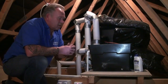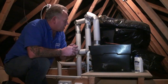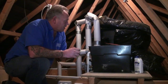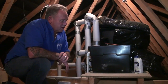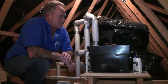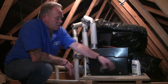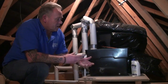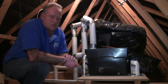So once again there's a kind of self-enclosed system which allows for topping up your heating, taking care of any expansion, and taking care of any overheating of the system so that it's pretty much self-contained. You'll see that there's a tub of central heating protector next to it — the plumber will always leave that there just to show the next plumber that some protection has been made, and it's a good idea to call them in occasionally to get that protection done.